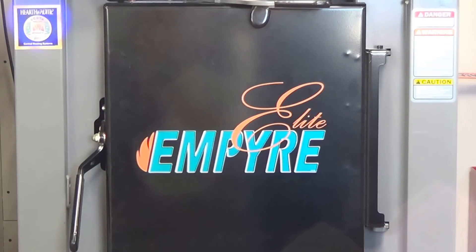At this stage you wouldn't want to load the stove unless you had to — like if you were leaving somewhere. It's obvious the stove is up to temperature and the fan's not running, so it doesn't need wood. You want to burn these units through complete cycles if you can. At the end, stir up the coals and I like to scrape off any creosote on the edge of the stainless where the fire brick meets — that's where it tends to build up.